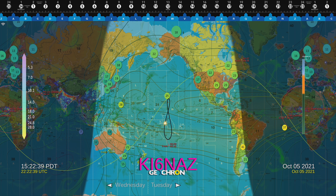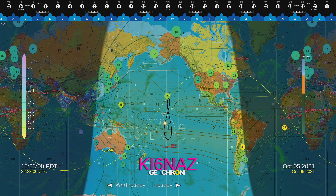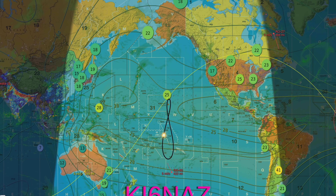There you go — that's the Geocron the way I normally run it. It shows you the ISS in that yellow line that's undulating up and down as a sine wave across the map, and the smaller FM satellites show up in red. AO-91 in particular has the footprint displayed. Those green lines — they look like little blobs — those are areas of frequency capability. The band generally is good for about 25 megahertz from here to the East Coast. If I wanted to talk to Japan, I'd probably need to use 20 meters — from my home location at 17 meters all the way over to Japan which says 19 and 18, I want to be below the maximum usable frequency, so I would use 20 meters.